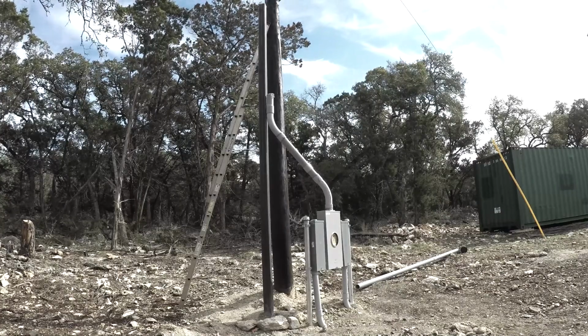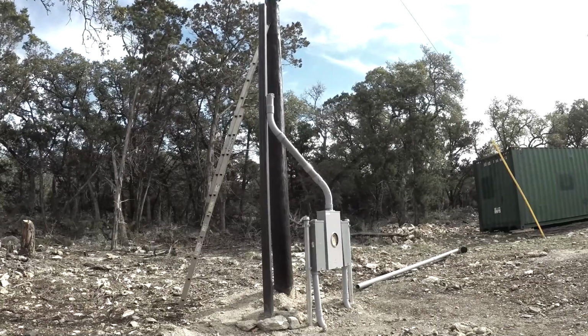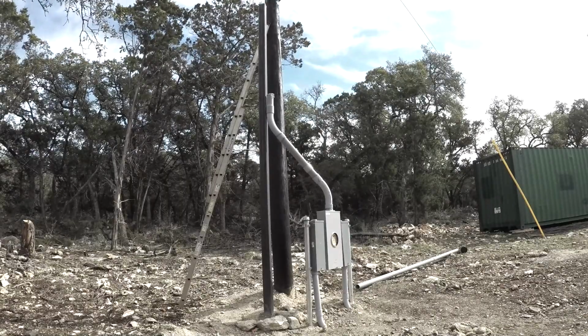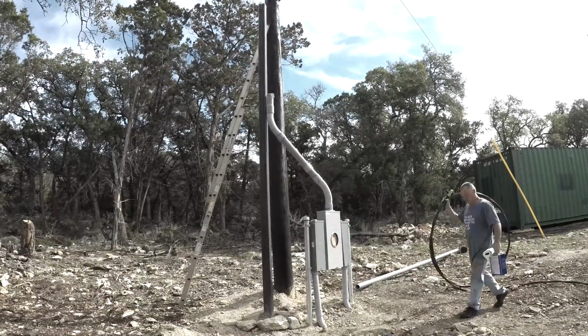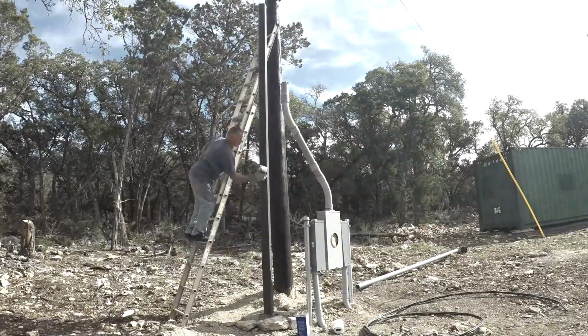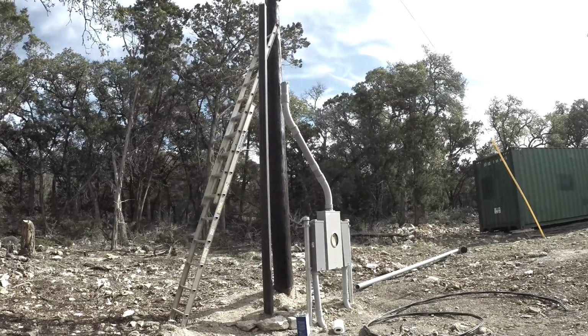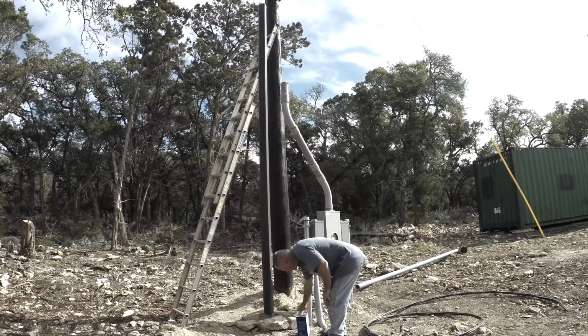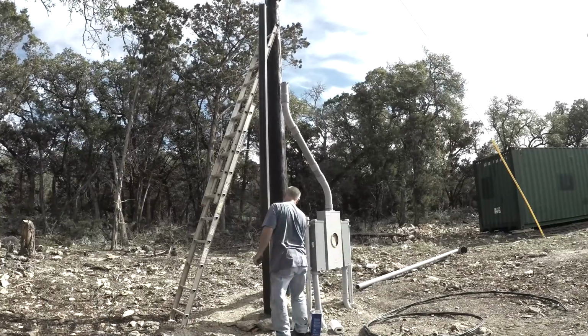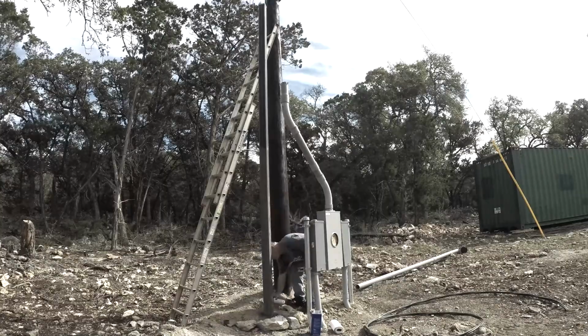In a prior video you might have seen me attach the PVC to the PEC pole, which in some cases they do, but in this case they wanted us to do the member-owned pole. So the representative offered this solution, which is you just swing the PVC over. I plumb bobbed where the hole should go for the pole, and then swung the PVC over to that spot. And here we are. I'm going to paint the pole.